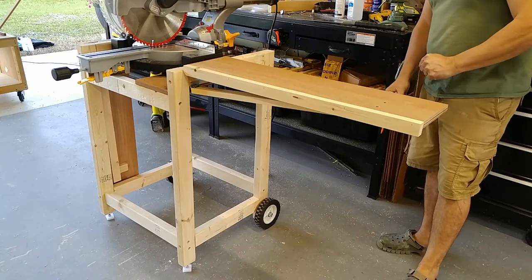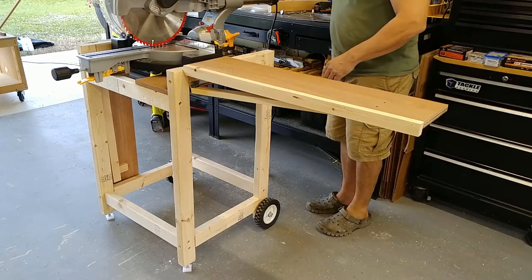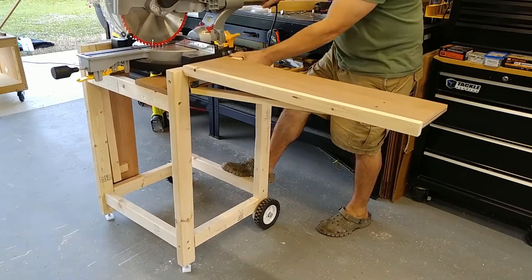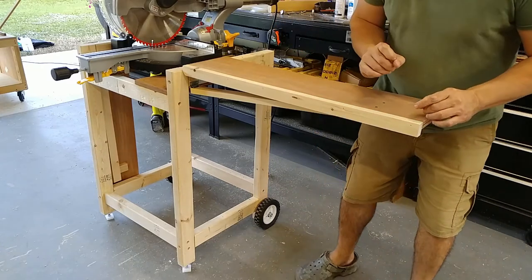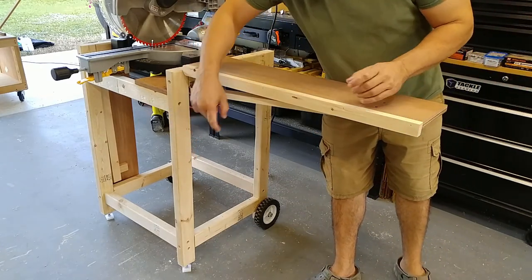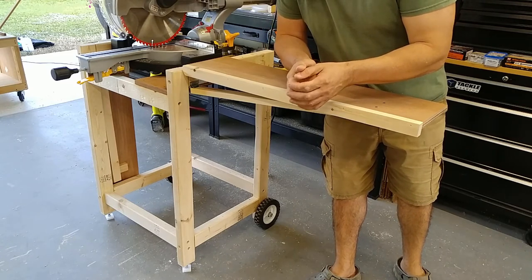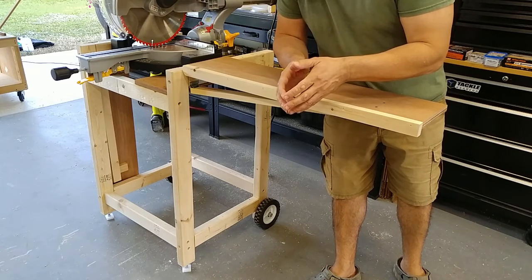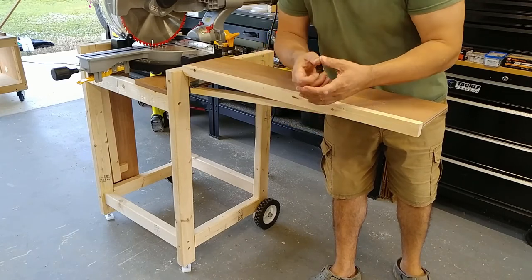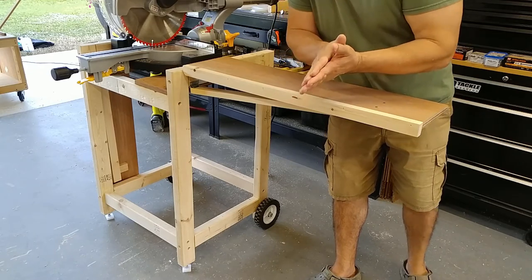The wheels came out very, very nice, very functional. You can just lock up the carriage and tip it back and dolly it wherever you need to. Something that I want to point out is that I did change the feet. That is nothing but a square piece of polypropylene with a bolt through it. And tonight I'm going to be gluing a piece of rubber to it, using some inner tube patches, just to give it a little bit of friction.